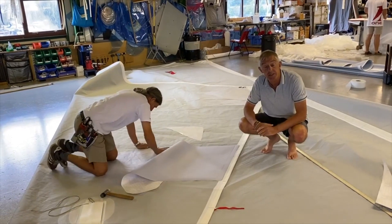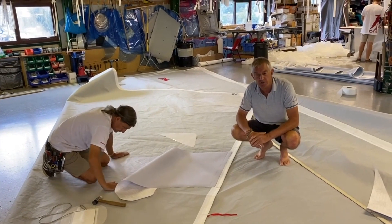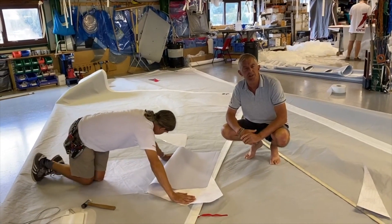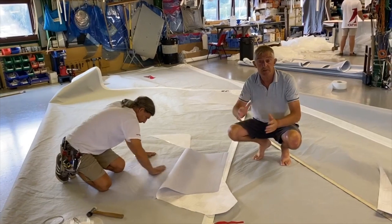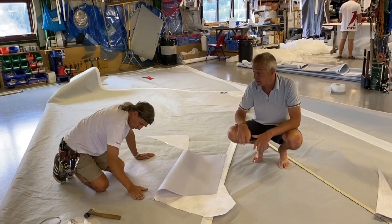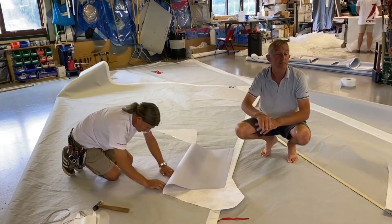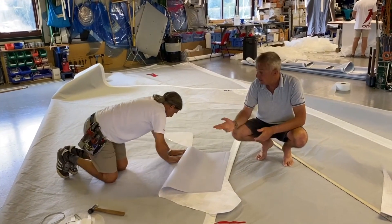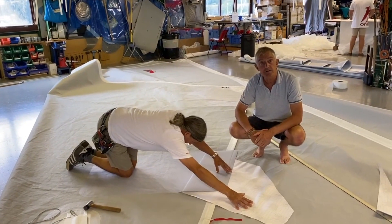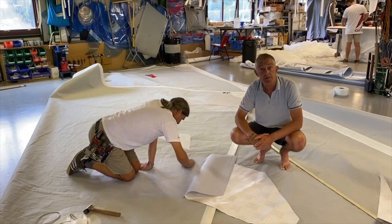Still on the J2 — the J2, although it only overlaps the mast a little, you have got mounted about four metres up your radar, which as I understand you've increased the size of. So that projects in front of the mast, and we need to protect the sail as you tack and maneuver as the sail wraps around the radar. So here, Neil is fitting a self-adhesive chafe patch to the membrane, to the sail, so that we minimize any damage that might occur.